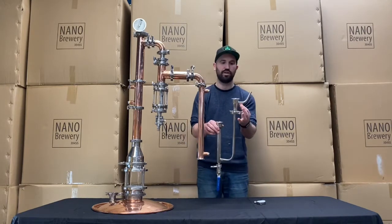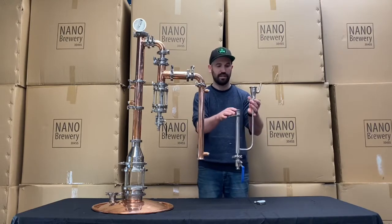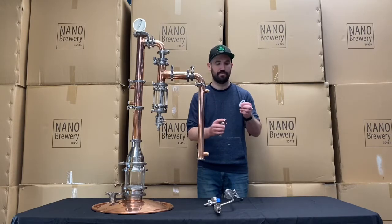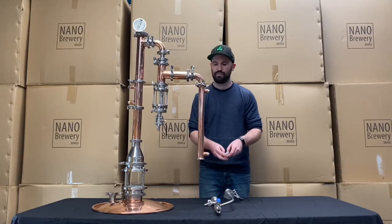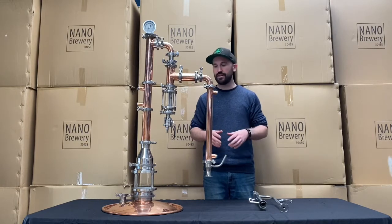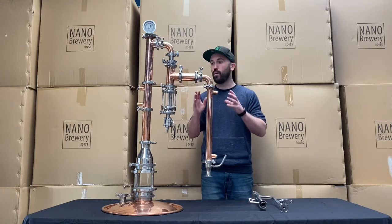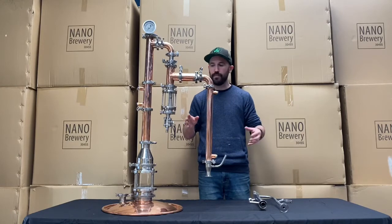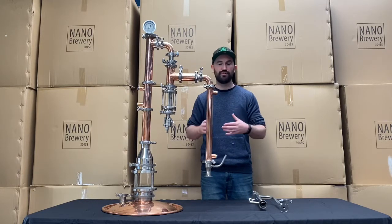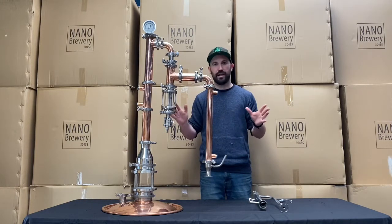You've got your surge breaker that's connected directly from your product condenser. This parrot assembly is going to go with these one and a half inch clamps and beaded seals directly on the bottom of this product condenser. It's also worth noting that in these particular advanced stills, there's a lot of weight — you've got your four inch sight glasses, the copper components, your gin caddy and parrot setup. These are more designed for your strong boilers: milk can 60 litre boilers or your nano brewery pots from 70 litres and above. I wouldn't be putting these on any cheaper boilers in the market as they just wouldn't be able to handle that sort of weight.